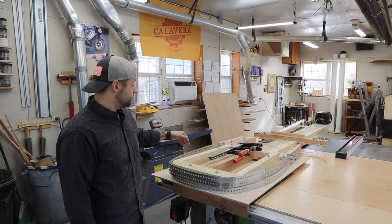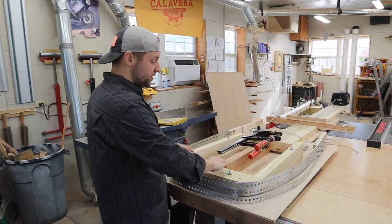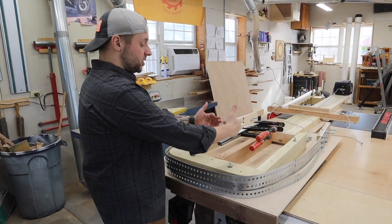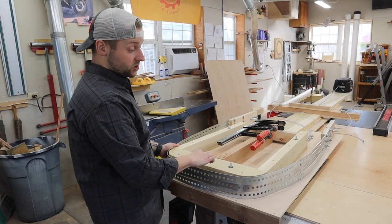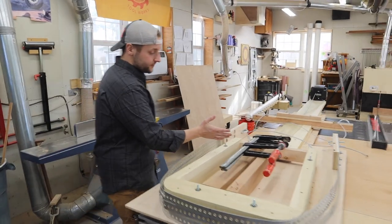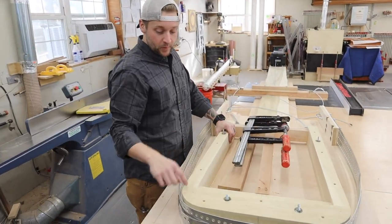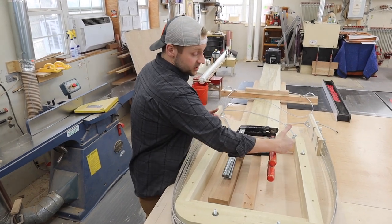This is the bending form. We're building a chaise lounge — four of them actually — and this will be the back section. There'll be a bolster pillow here. We're bending inch-thick by three-and-a-half inch quartered white oak, and these will end up getting cut off somewhere around here. We have two and a half degrees that these are toed in.